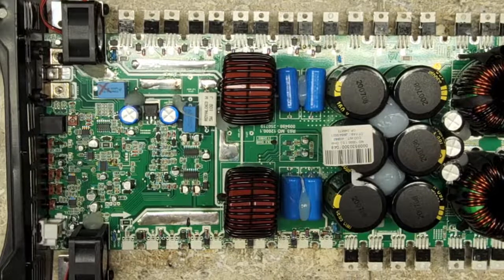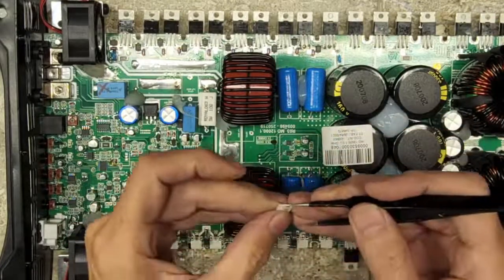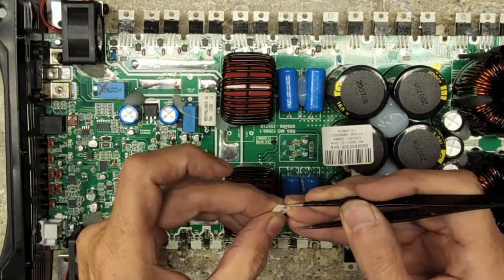A 4.7 ohm gate resistor, right? Is that what these are using, I think? Yes, 4.7 ohm gate resistors. Let me grab some gate resistors real quick. 4.7 ohm, 0805. All right, so I've got some good old 4.7 ohm 1% resistors here, 0805 size.